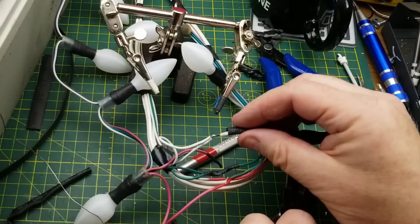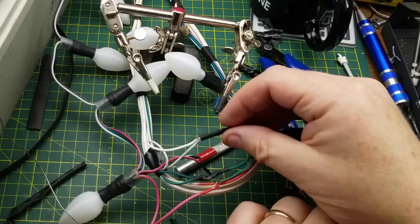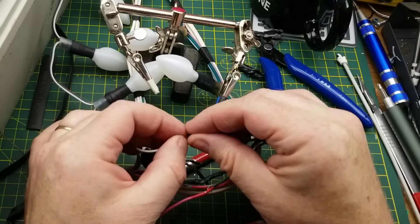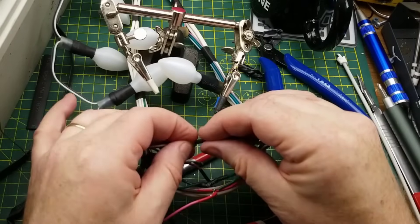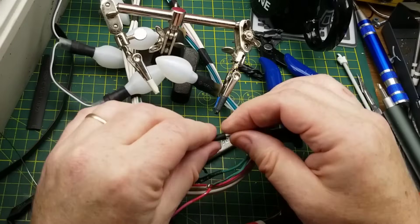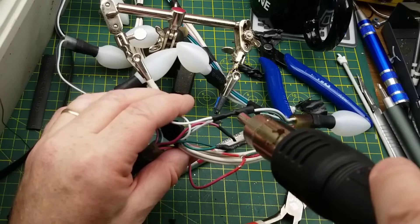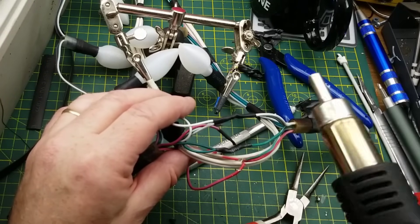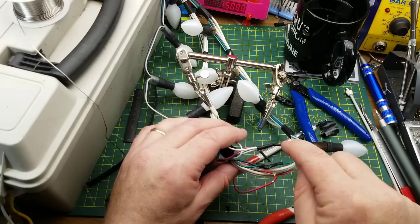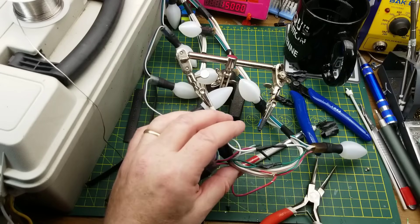There — that's much nicer. I'll slide up a piece of heat shrink over that, and just to keep it a little bit extra weatherproof, I'm going to tuck a couple of bits of hot melt glue — little slivers of it — inside the heat shrink as I slide it on. As I shrink it down, that will encapsulate everything and hopefully keep the water from ingressing. That's what I've done previously with the connections on these things, and I haven't had any problem in the four years that this stuff's been outside. You can buy heat shrink with hot melt glue pre-lining it, but that stuff's horrendously expensive and tends to only come in the larger sizes, not small stuff like this.